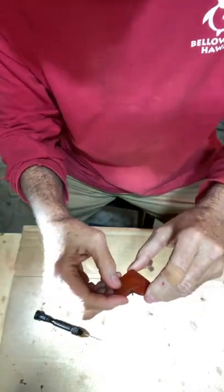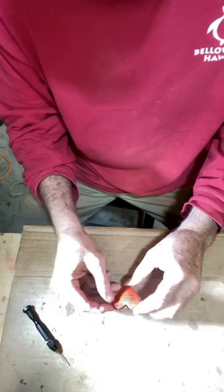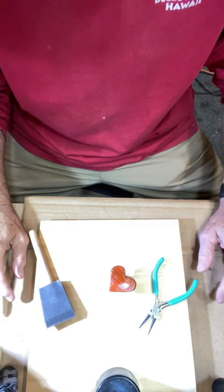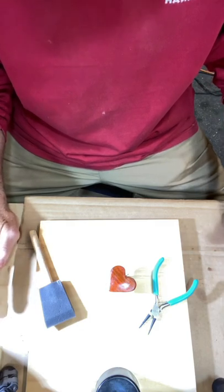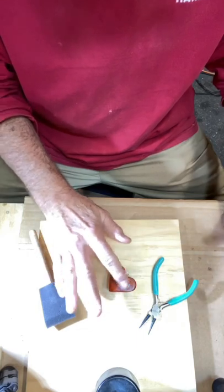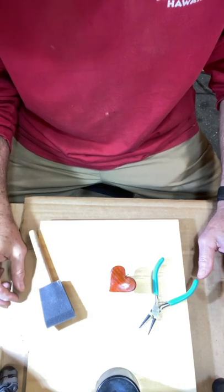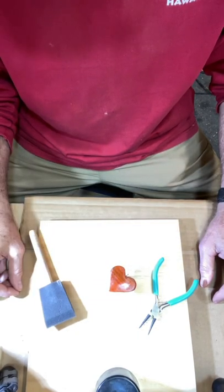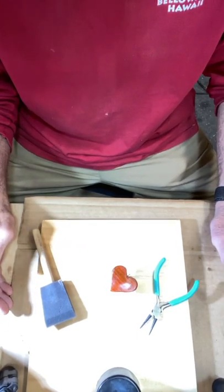Once you add your screw eye, the last step is to polish this with some polyurethane and we'll almost have a finished heart. Today I'm going to show you the quickest and easiest way to provide a finish, but there are also other ways — one would be with boiled linseed oil: rub it around, let it sit for an hour or two, wipe it off with a dry cloth, repeat that, then come back with a paste wax and buff the piece really well. That'd be a beautiful finish, but it takes multiple hours.